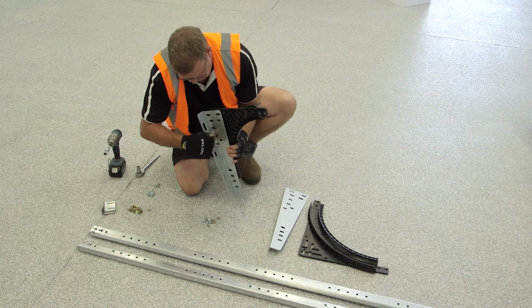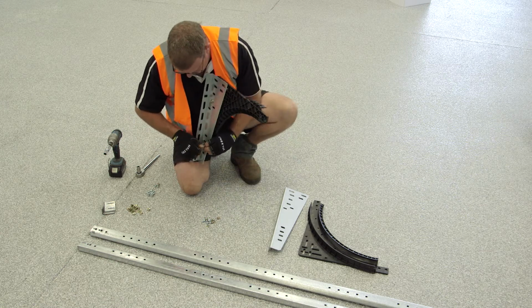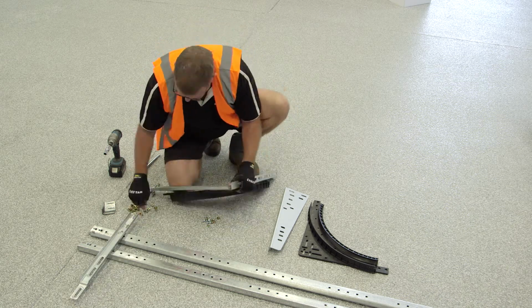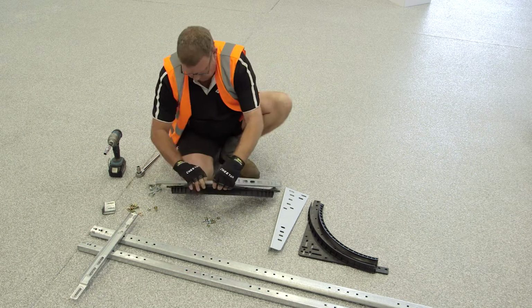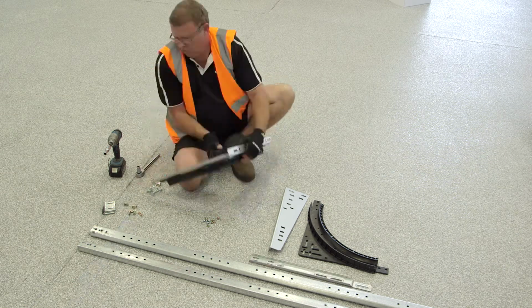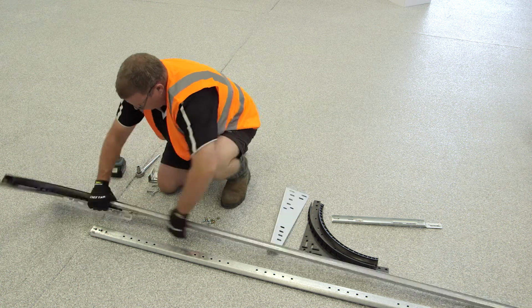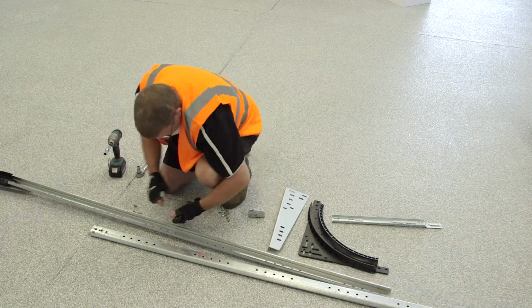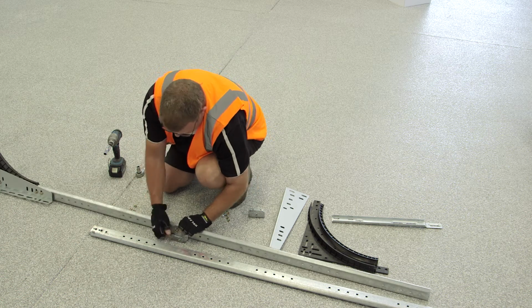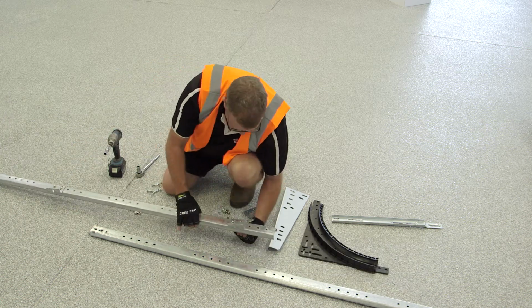Now assemble the tracks. The 4 longer 5/16 flathead bolts are for the 2 top slots in the top bracket and polypropylene curve, and are long enough to accommodate the horizontal brackets and the end bearing brackets, which will be fitted later. Ensure the joint between the vertical and polypropylene curve fits snugly and fasten with the shorter 5/16 bolts. The angled track brackets should be fitted evenly using the small dome bolts and whiz nuts.